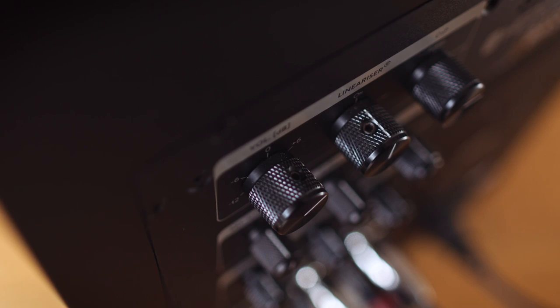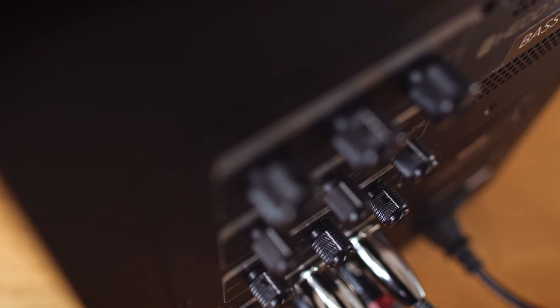switch on the back of the sub that will adjust the delay of its output accordingly. So if we move the sub up to 2 meters behind the mains, the Type 7, we can adjust a setting on the back of the sub to delay the mains even more. Or alternatively, if we bring it up to 2 meters in front of the mains, we can delay the mains less using that same switch on the back of the sub. So wherever we put our sub, plus or minus 2 meters from the speaker plane, we can maintain a fully time-aligned sub-sat system. I think that's pretty cool.